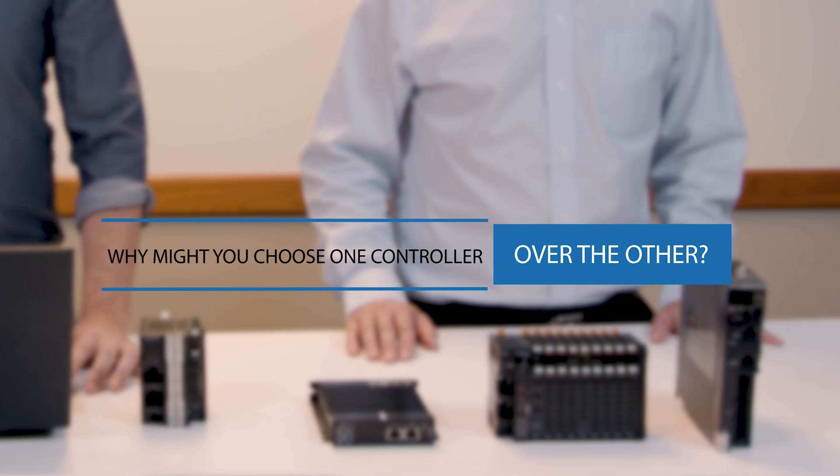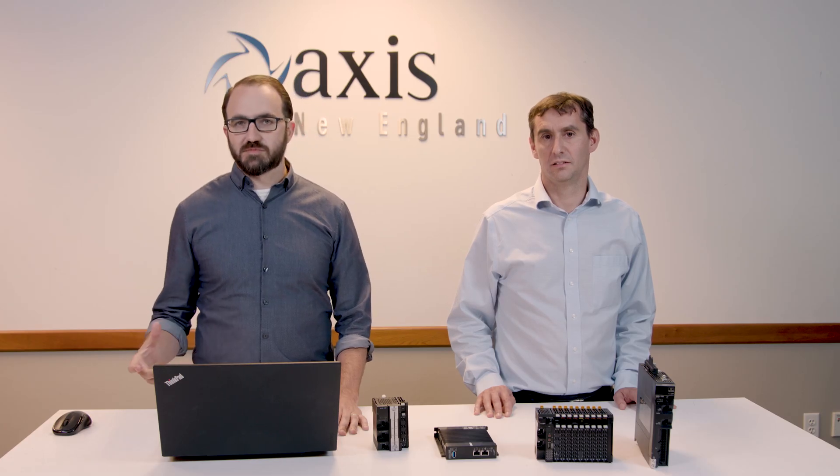One of the things that separates the NX-1 from the CK3E is its ability to communicate to higher-level IT systems. It has a built-in OPC UA server that enables that level of communication. It also has a SQL client built in, which allows you to very easily set up a SQL client and remove any middleware or PCs out on a machine to help reduce maintenance costs.